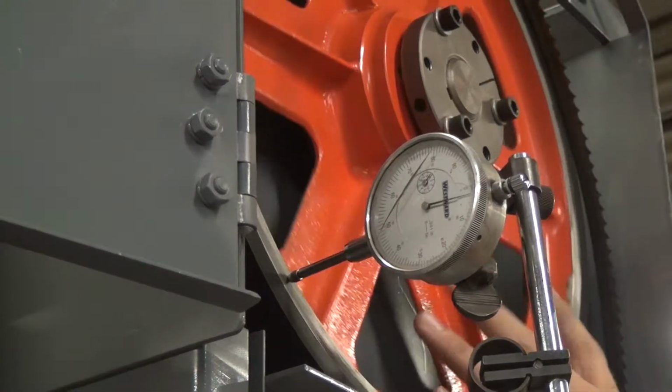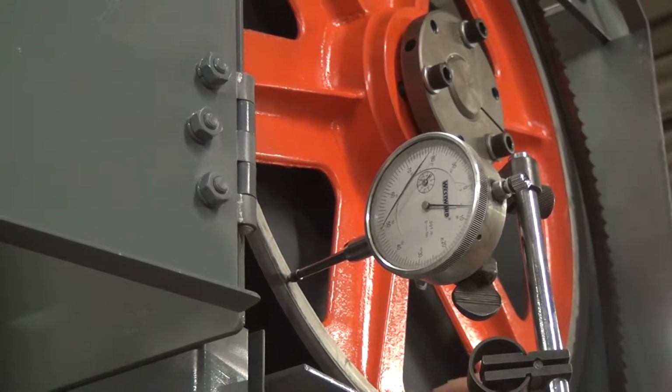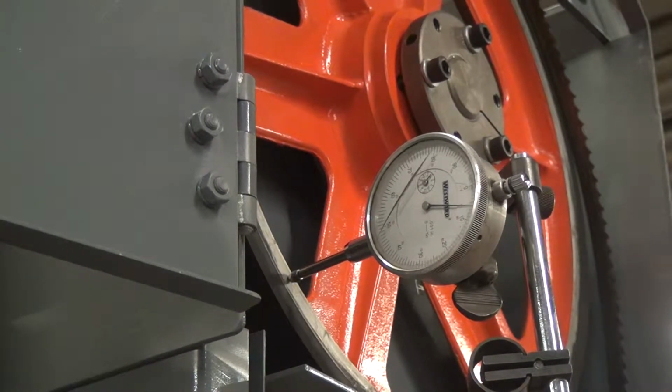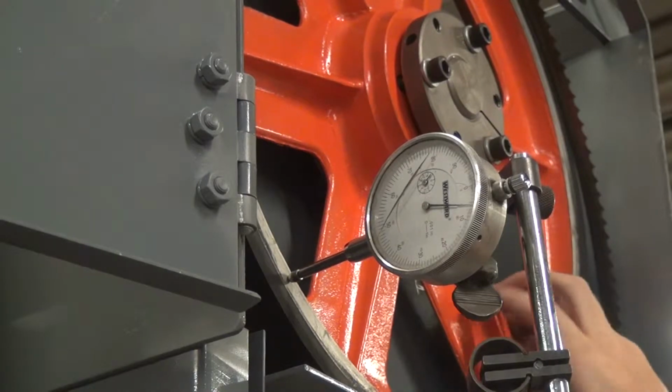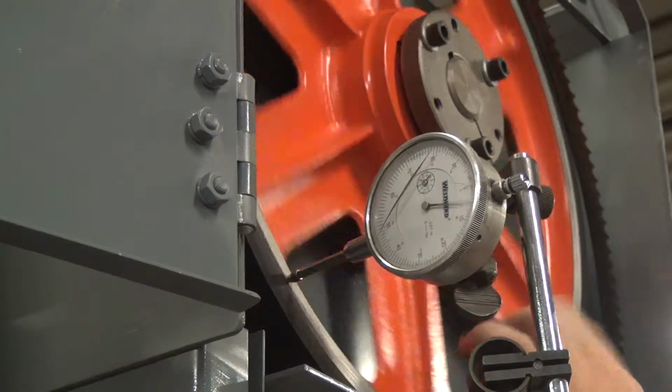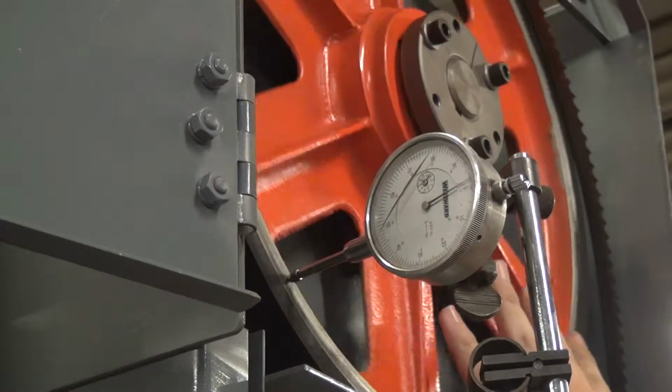We've got our torque wrench set to 250 inch-pounds now. It's important to note that once the bushing is tightened to 200 inch-pounds, it is completely stationary on the shaft, and we don't technically have to tighten any more to hold the bushing on. What we do want to do is pull or push on the different edges of this wheel to make sure that it's straight with our shaft. So we want to adjust out all of the run out. To do that, we'll set our torque wrench to 250, and we'll watch this dial indicator as we roll the wheel around.